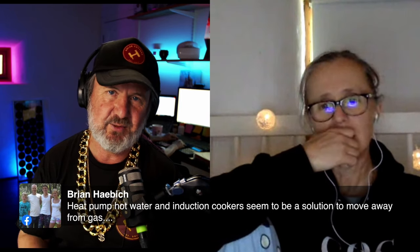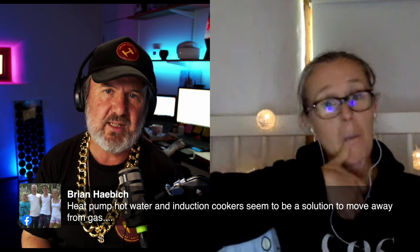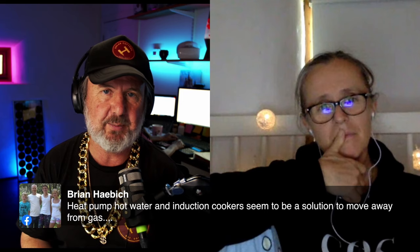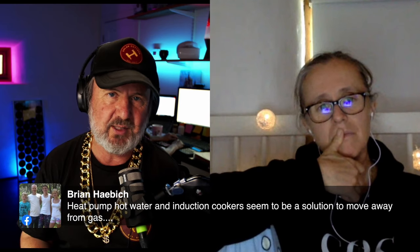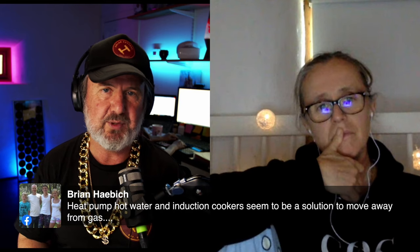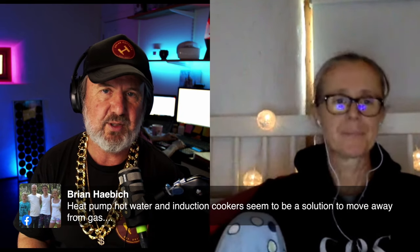Yeah, there is actually one over here at the lab, so I should point it out to you sometime. But they're like 3 to 5 times as electricity efficient as a regular resistive element hot water service. And they've got a very small peak demand. That means when you turn them on, they only draw like 1,000 watts, not 2,500 to 3,500 watts. So they're not a big load on a small system. So they're a very popular choice if you don't have access to the sun or you're constrained by roof area.